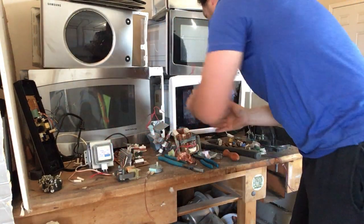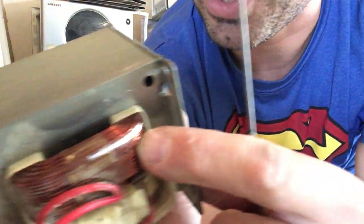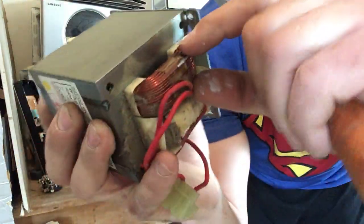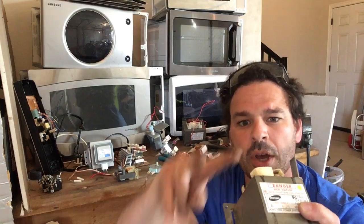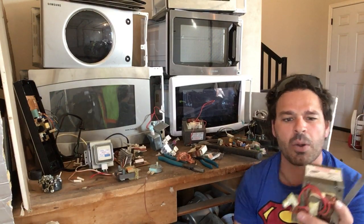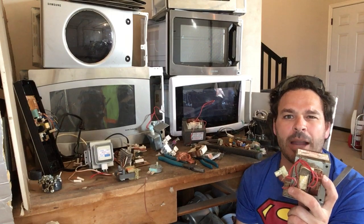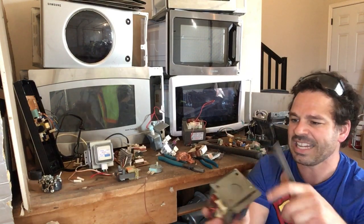You want to make sure you check the two spools. If I take a file and scratch it, underneath it reveals a metallic look — because unfortunately this spool is aluminum, just disguised to look like copper with a coating. However, check both spools: scratching the other one reveals copper. In my opinion copper is the scrapper's gold. Even if one spool is copper it's well worth removing it — it'll be worth a lot more as number two than transformer weight. I also have videos showing how to open these transformers with a grinder.